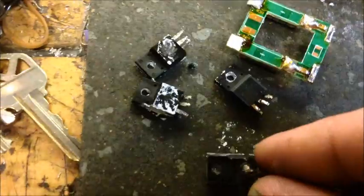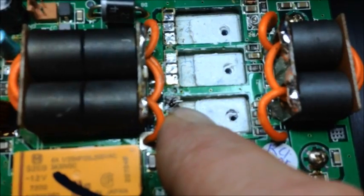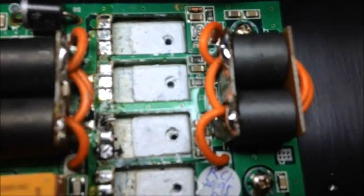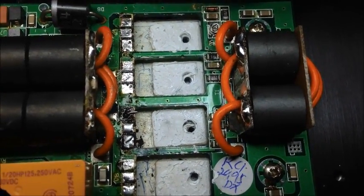Here's the aftermath of the MOSFET transistors — good old hole, leg done blown off. We've cleaned up everything, all the soldering. He did burn one of the legs off of the traces, so I put a little wire in there to extend it out. That's usually what happens with these MOSFETs — that's the kind of damage they do. I think it's static electricity more than anything else.